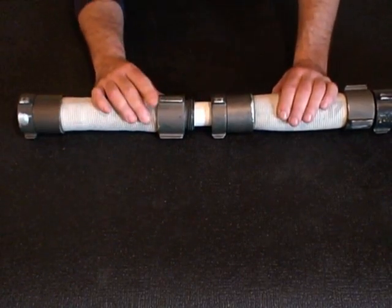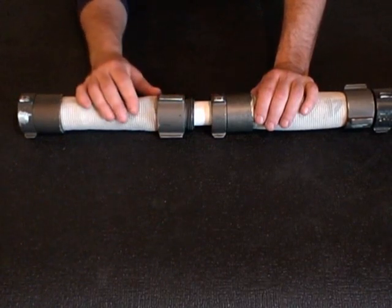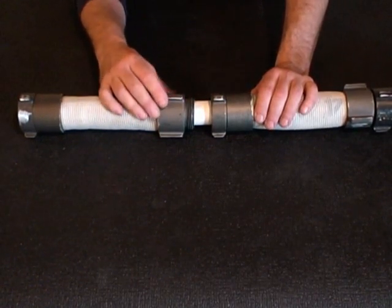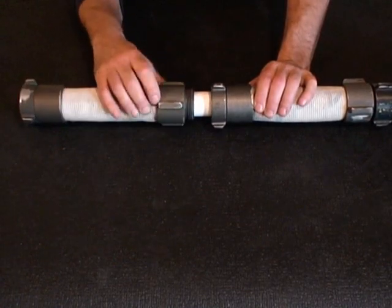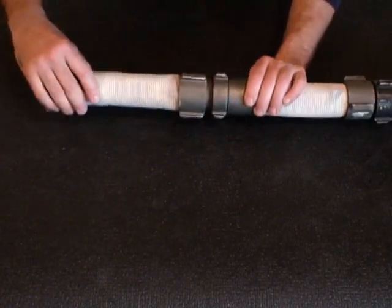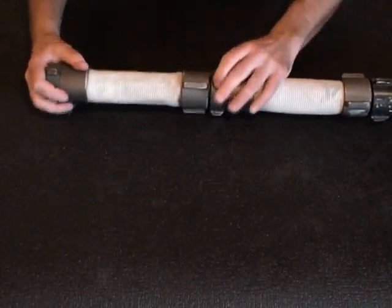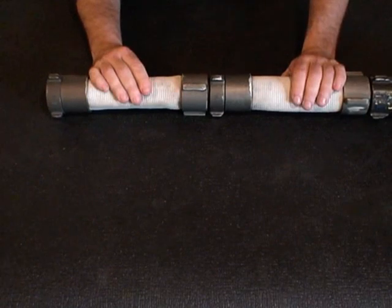Looking at the male, it's a single piece. The threads connect to the female and eventually the nozzle. What's different on the male coupling is that the spanner lugs are bigger and run the entire length of the shank. When you connect both sections together, you can take the characteristics of each coupling and use them as a directional indicator.